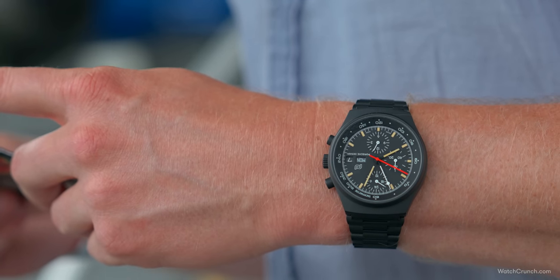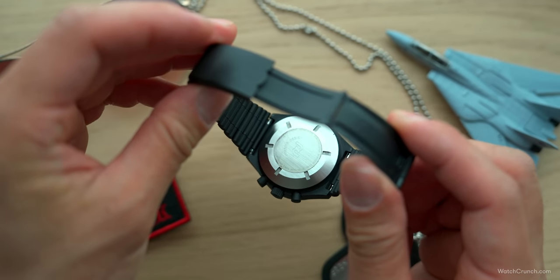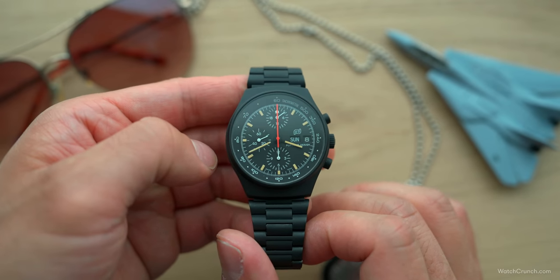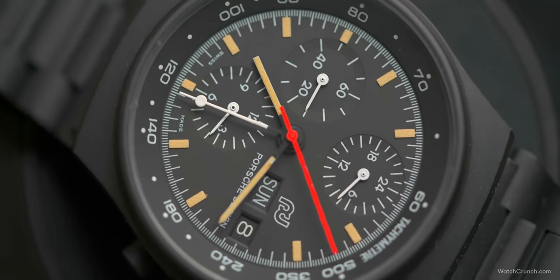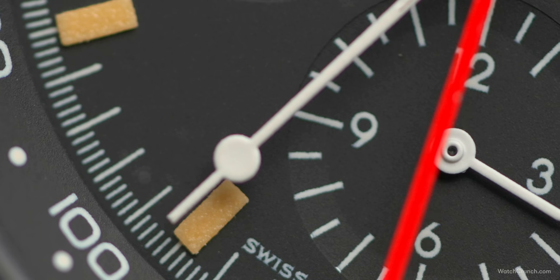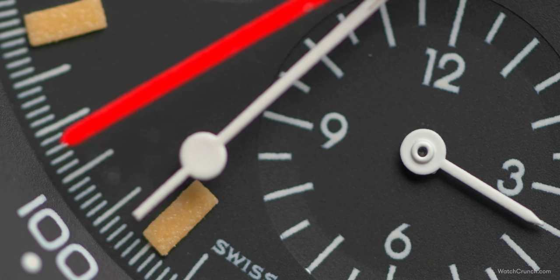Enter the LeMania 5100. This great manufacturer's big claim to fame is probably attributed to serving as the base of the 321, which took Omega to the moon. The 5100 found in this watch has some features that make it even more suitable for military use. Delrin, a high-performance plastic, was used for multiple components to provide shock resistance, and a vertical clutch meant that you can leave the chrono running with minimal wear. The movement proved so robust that versions of this watch were deemed by the German military to be fit for service. Those watches wore the military dial, and their minute counters had an airplane tip. One drawback of having a fourth hand on the center pinion is that this adds an additional millimeter to an already tall watch. The tonneau-shaped case does its best to hide the girth, but on the wrist it's still a bit of a hockey puck.